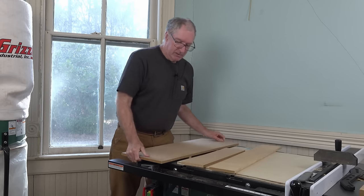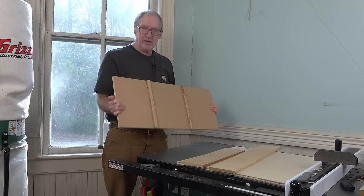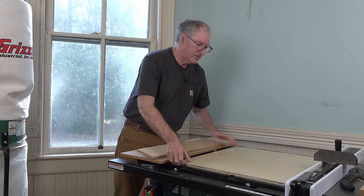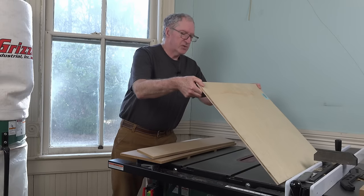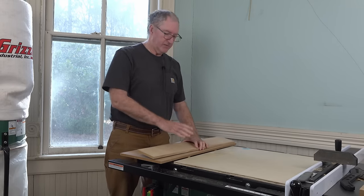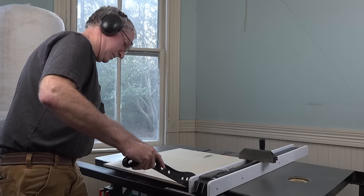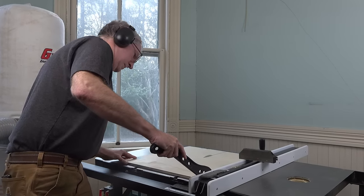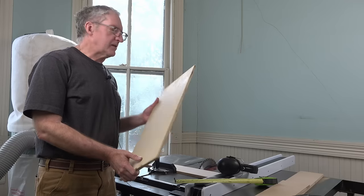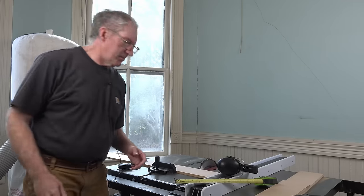The problem is that this one is no good — it's basically firewood now and I have to rebuild it. So I went to the home store and got a new piece of project plywood, which is nice and flat. The first thing I'm going to do is cut it in half. That takes care of the base plate. Now I'm going to go ahead and cut two side pieces.